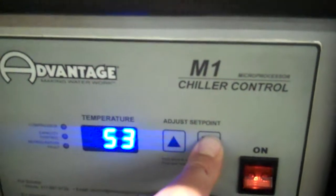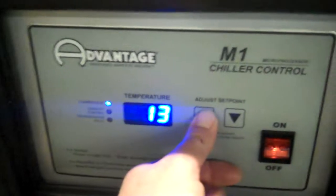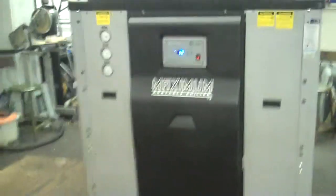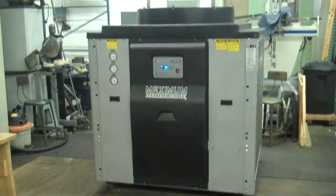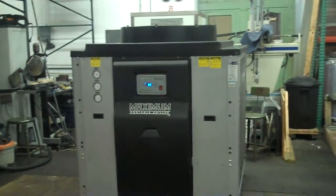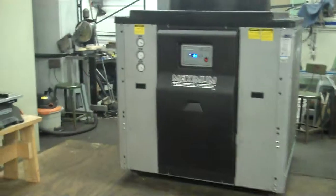You can actually bring it down to 20 — or even down to 10 degrees Fahrenheit. We don't want to go much below 29 right now as the setpoint, only because we haven't done an extensive test on how low the glycol solution can actually go. So that's the only reason we're not chilling it much less. It's going to go down to about 25°F before it shuts off, and on the outlet of the evaporator it's several degrees lower than that as well.